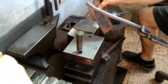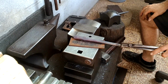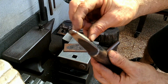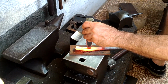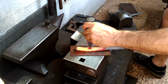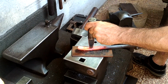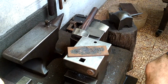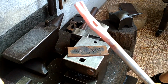As you can tell, this copper plate has seen a lot of cuts. This tool is made from H13 and it has a fine edge, but it holds up pretty well. And when it needs redressing, it's very simple to do. Rather than use a thinner piece of flat stock, my idea was to use round and remove that material, and then this way I could still have a decent amount of heft on the striking end.